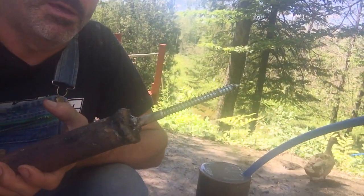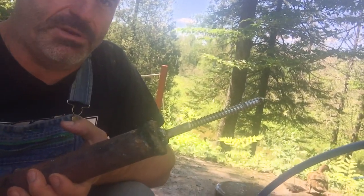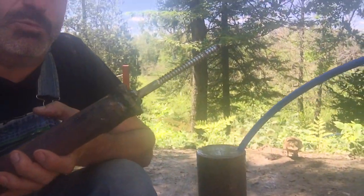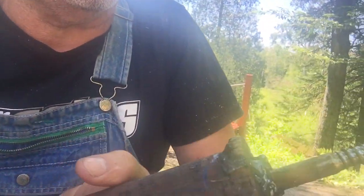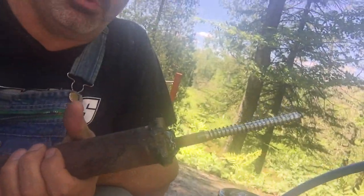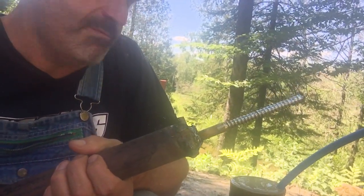...drive the well point down in there with the tractor and the hammer and all that other jazz — and breaking up the well cap driving thing — overall Dave constructed this super duper lag bolt. We're gonna try and drive it down there and get the last rubber stopper out from when it fell down the well before.